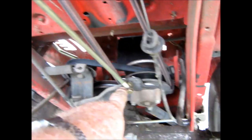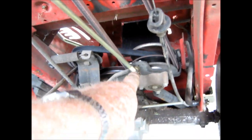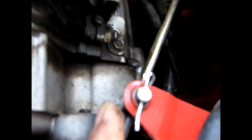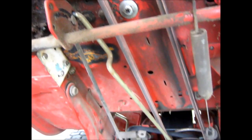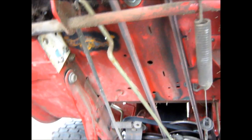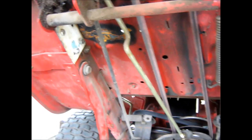I've adjusted this rod right here — didn't help — and I've adjusted this little rod right here, and that didn't do anything for it either. I noticed that as soon as I would push the clutch in, it comes to an immediate stop. So I'm starting to think the problem is not so much the clutch as it is the brake.